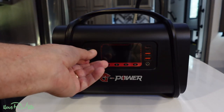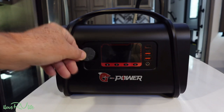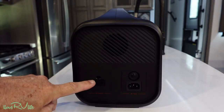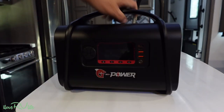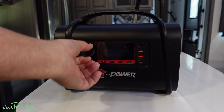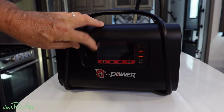You have a 12-volt carport or cigarette lighter style adapter that handles 120 watts max — roughly 10 amps at 12 volts. There's also a single AC output rated at 500 watts. For capacity reference: a 40 to 60-watt portable refrigerator will run 12 to 13 hours, and a 40-watt laptop brick will give you 10 to 12 charges.